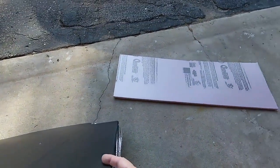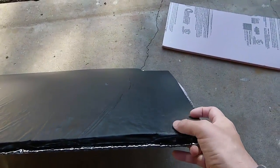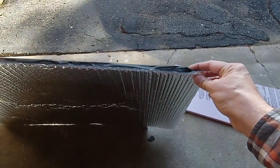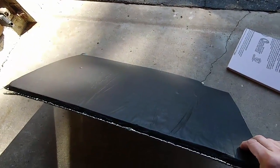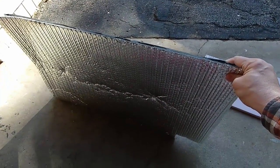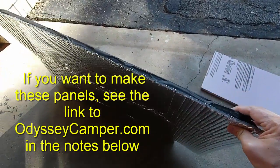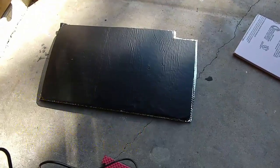For Phase 1, I used this insulated board covered with pleather vinyl material and backed with some Reflectix. What I found is that these panels were really too much in the summertime — too much insulation. They're also kind of bulky, and securing them to the window requires some type of attachment. I used suction cups and threaded rod, which worked, but it's just a little too much unless you're going to be out when it's colder than 20 degrees.